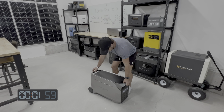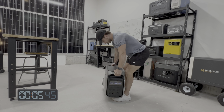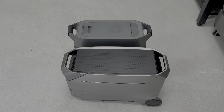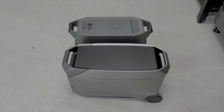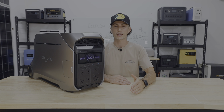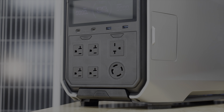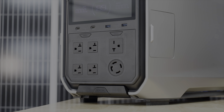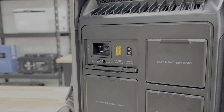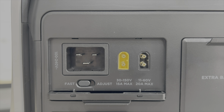First up, this thing passes the tiny baby lift test — it weighs 113 pounds, definitely a little fatter than the Delta Pro used to be, but it's also a slightly bigger unit with a slightly bigger battery. It has a 4,096 watt-hour battery bank and a 4,000 watt pure sine wave inverter which does split phase — so it's a 120 or 240 volt inverter with an 8,000 watt surge capacity. In terms of charging, this unit has a standard 1,800 watt AC input, and it makes a really weird cricket sound when charging from the wall.